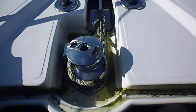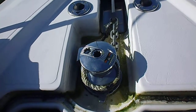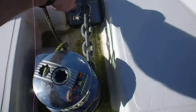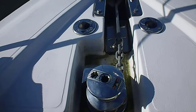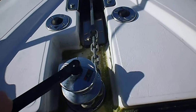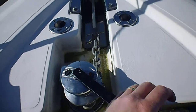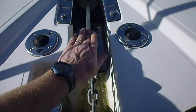Quick video on how to use your winch correctly. First thing you need to do is remove any restraining devices you have that stop the anchor from deploying. Take mine off, put it to one side, put the winch handle in the middle — turning anti-clockwise slackens it off, and then the chain and anchor deploy with a little bit of a push.